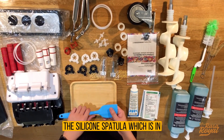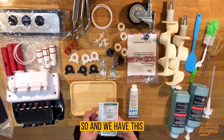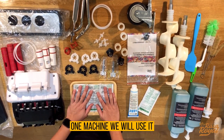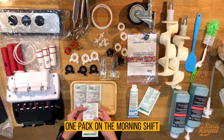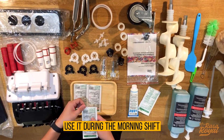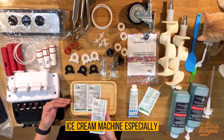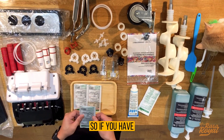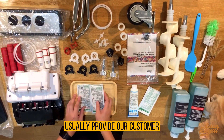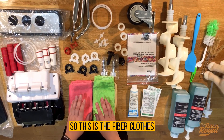We have the K5 sanitizer. For each machine, you use one pack per morning shift. The K5 sanitizer is diluted in water and used during the morning shift to prevent milk stains on the ice cream machine, especially on the stainless steel parts. If you have three machines running on the same day, you need three packs. We usually provide customers with 30 packs per month.